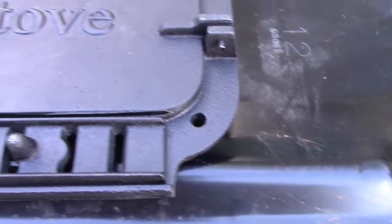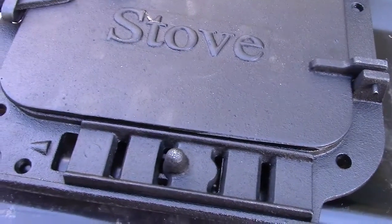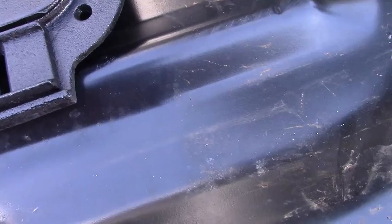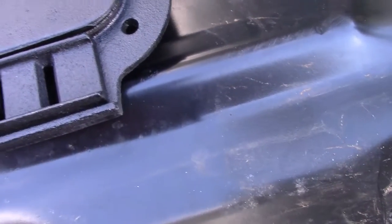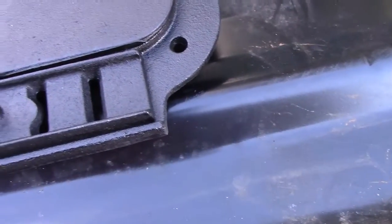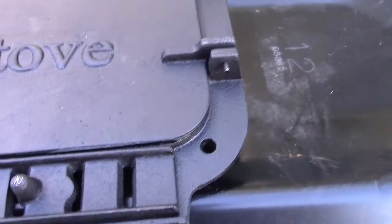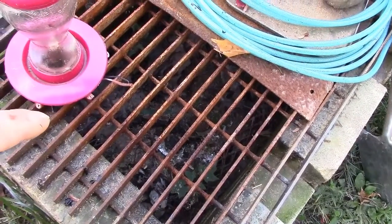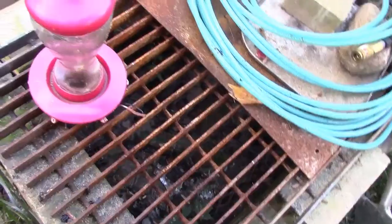The only other thing I'm going to have a problem with is putting the grate in here, because I want to put a grate in there. I have stuff to do it with, but I'm probably going to have to just piece it in somehow. I'm going to have to cut it bigger out here so I can get the grate in, and then once I get the grate in, I can reach in the hole and tack weld it on the other side, or put an L bracket there so it can sit on the L. Regardless of how thick it is, it burns out. In my little wood burner stove inside, I actually use this kind of stuff — but after a year or two years of burn, that just burned right out, didn't even work. The heat just destroys it, so I don't want to weld anything in there permanently.